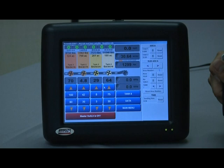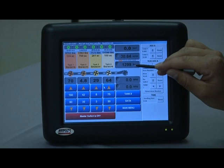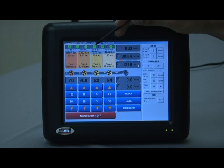The applied product indicator works just like the acre counter — there is an amount of product calculator that follows every tank individually. Touching it toggles between tanks 1, 2, 3, 4, and 5, back to 1 again. So you can keep track of the pounds of product for each product in each tank individually with that feature.